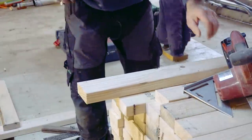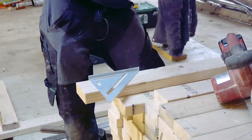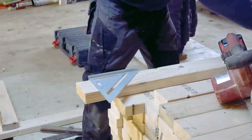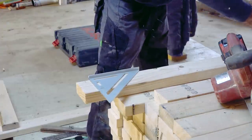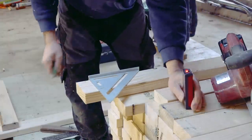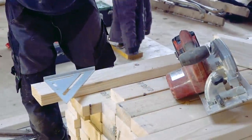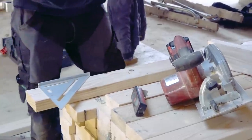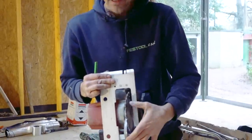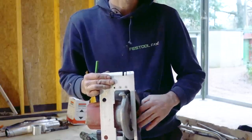What you're eliminating is measuring, trying to hold the tape on the stud. With CLS or any regular rounded timber, when you offer the tape up you sometimes don't read the full length. With the Disto on the block you're measuring exactly to the flat, which gives you a really nice measurement. If you want a stud that's tight you can make that block a little bit less or shave a bit off.